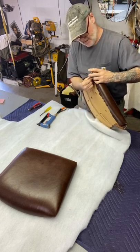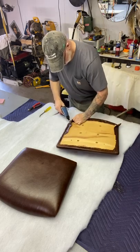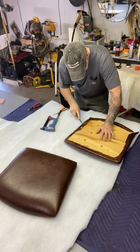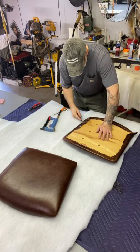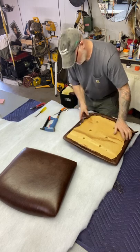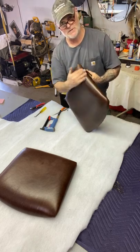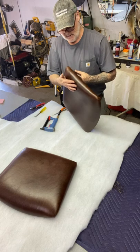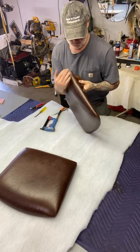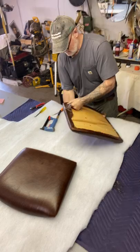Make sure she's laying flat. Bring her up. Yep. And then on this one, we're going to have to come back a little bit further, which happens. Get ourselves to lay flat. So always come up. That's why you don't glue these edges around the edges, just the field in the middle. And you silicone these edges. It'll give you, see that? Look at that. Wiggle room. And then you just pull it to the edge and it finds its own gait. So you're happy with that.